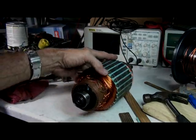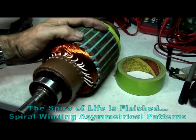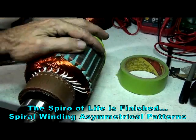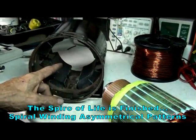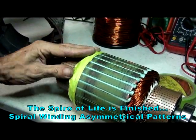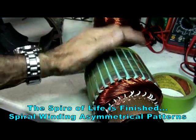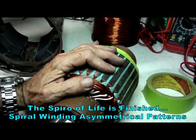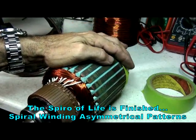Okay, we're done — we got it all done. Before getting it into the stator housing I highly recommend putting dual layers of masking tape around your winding — basically on the part that's going in first — because it's going to suck it in so fast that you won't have control of it and it might kink the wire, and this can prevent that from happening.